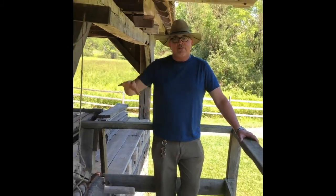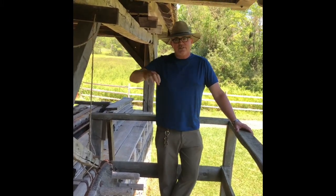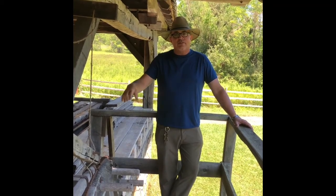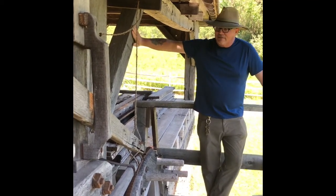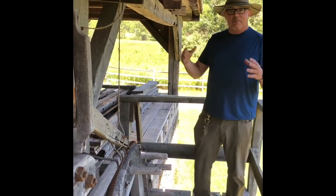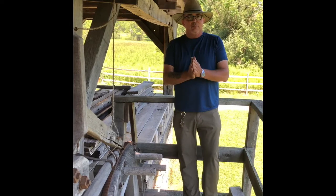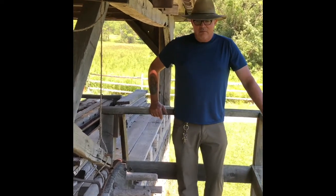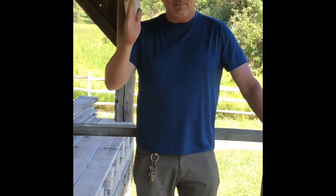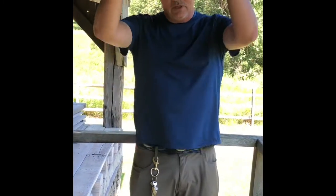The mill is an original 18th century mill. When they started building these mills here in the colonies, they would have looked pretty much exactly like this one - very typical of a mid-18th century sawmill. This technology wasn't developed here; it was developed in Europe, probably in the Germany or Switzerland areas. You can see a lot of clockmaking influence in the drive mechanism. Before this technology was available, every single board for building a house, a barn, or planks for decking a bridge had to be cut by hand using a method called pit sawing. In pit sawing, you literally dig a pit in the ground, lay your log over it, with one man down in the pit and another standing on top of the log, pushing and pulling on a whipsaw all day.